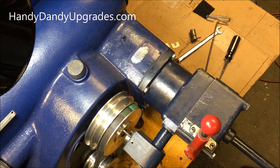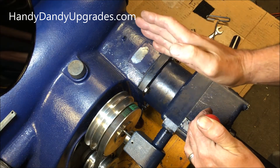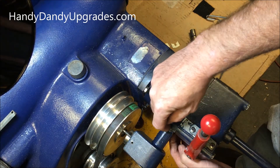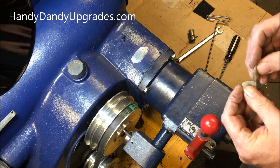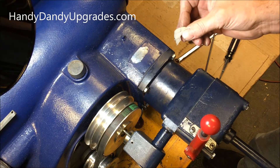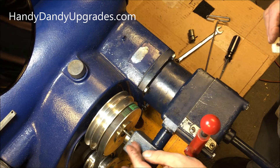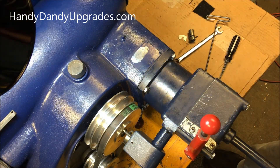Okay, that's pretty good — that's actually all there is to it. First, make sure you get the coupling correctly tightened down and lined up. Then adjust the gearbox this way, adjust it here, and if you can't get the distance right, add shims underneath — you can make them out of paper, a thin sheet, a piece of plastic from an old oil bottle, or even cardboard if you need something thick. You just need to get it pretty close to on-center and it won't make any noise, and that will keep all this from beating itself to death. Anyway, hope this helps — thanks for your time, and if you like these videos make sure to hit like and subscribe.